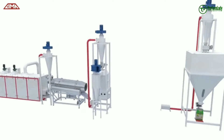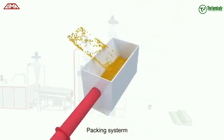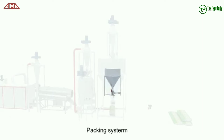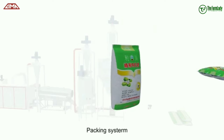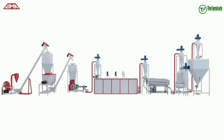From the cooling system, the feed has been transported with the aid of an air conveyor into a packing system. The packing system helps to pack the feed into bags and also ensure it is properly sealed. As you can see here, this is the packing system and we can see the feed bags. A scale weighs the feed based on the required size and then it has been sealed. Amazing process — and you actually do not need a lot of people working in a feed mill like this because every step is automated.